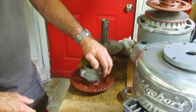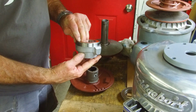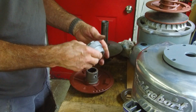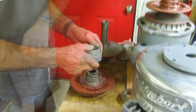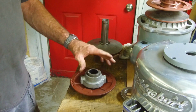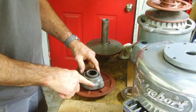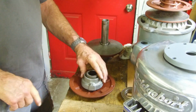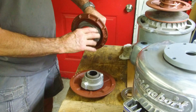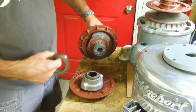Okay, we're going to go over to the arbor press and just press that together. We may put that one down in there first. And then press that down into there. Okay, arbor press handled that perfectly fine. We pressed this down into that bearing there. Press this, holding these two ears here. Press that on there, no issues. Okay, so these are brand new bearings, both sides the same bearing there as here. Both of them are sealed.